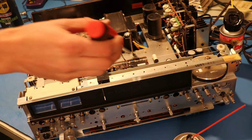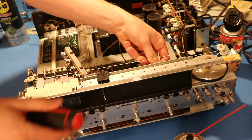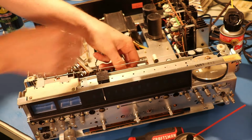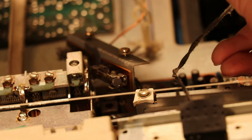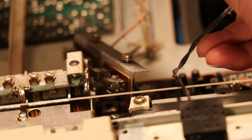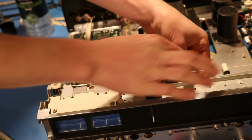These plastic housings on these bulbs here, this is the absolute worst decision that Marantz ever made in the production of these receivers, is they put these crappy little plastic tabs on this lamp housing to hold down the assembly here. And you can see right here, let's see, can we zoom in on that? You can see right here, this tab straight up broke right off. So we have nothing to grip onto the housing with anymore because it became so brittle, it's just gone. So anyways, let's remove the one we know to be bad.